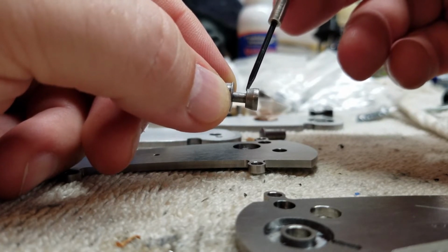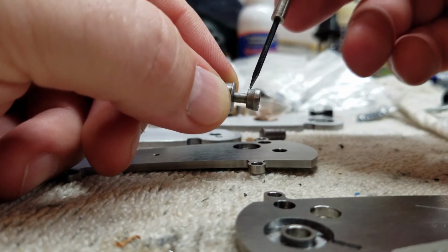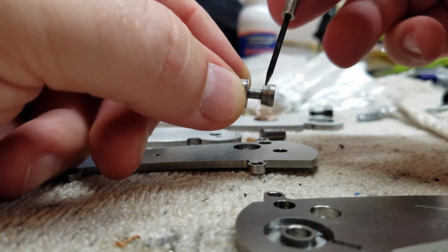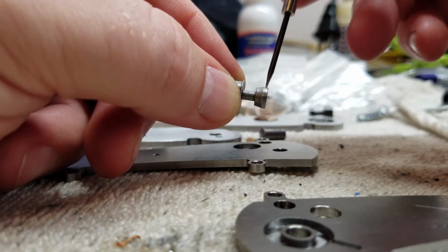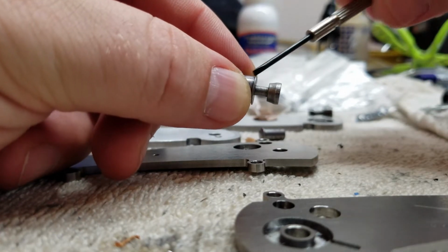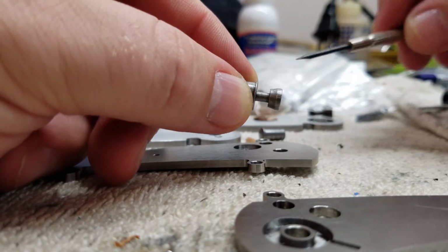The second part is the diameters that are used for the taper section and the flat. This small diameter at the small end of the taper section, I could make larger and still use the same taper angle on my lathe, and make a new button that will engage with less movement. And it will still engage at a large diameter. So one way of fixing this issue is to make my own button to the profile that I want. I can shorten the overall length of the button, which would allow me to custom make the width of my knife exactly the way that I want.